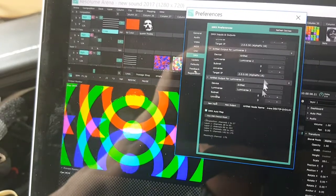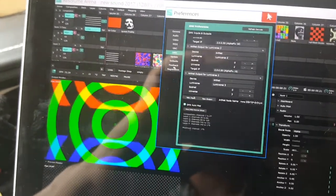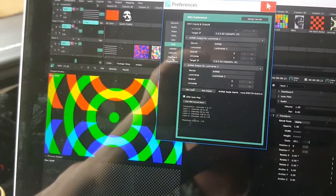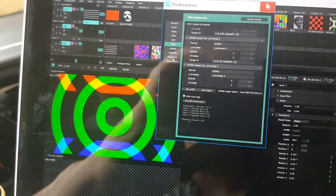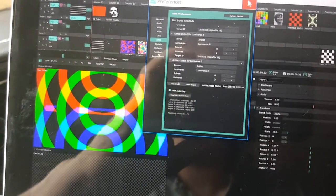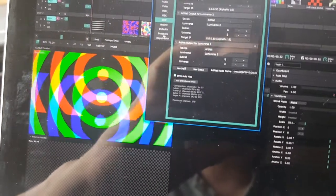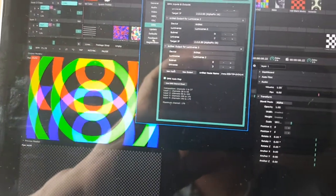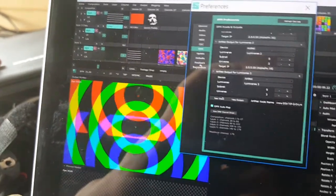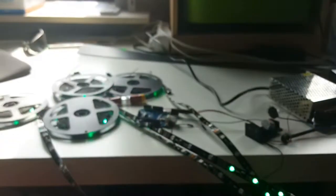The settings are pretty easy this way. Since I only use 50 pixels per LED strip, I could fit multiple strips into one universe to use fewer universes — placing one strip after another within a single 512-channel universe. But in this case it's not necessary. I close this panel and the LED strips are doing what Resolume tells them to do.